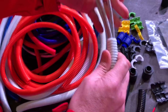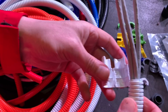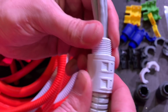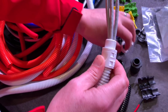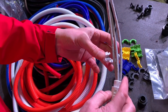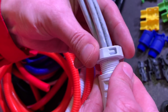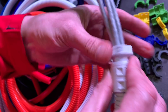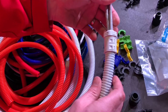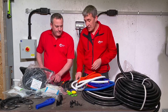That doesn't stop there. Next, fit a gland. Imagine you'd already had a pre-terminated end on there and needed to slot them through - the gland just clicks into place. And the lock ring is in two halves as well. It just clicks in and down onto the gland, and then we have a two-part lock ring that clicks into place. Job done.